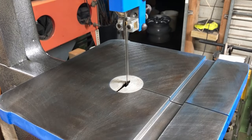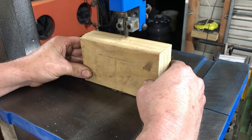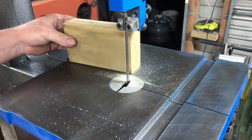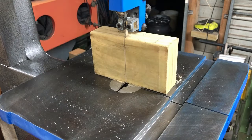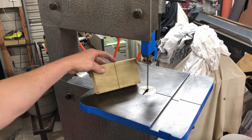This is the first time cutting some wood, and this is a test that Alex mentions as well. You cut a little bit into your piece of wood, turn the saw off, then flip your wood over and bring it in from the back — if it fits on your blade then your table is square. It's a little bit late at night, that's the first cut I've done on it and it went pretty well.